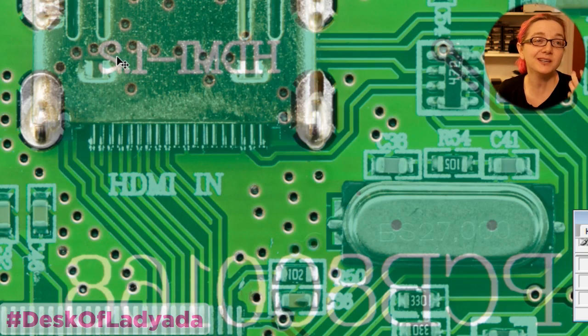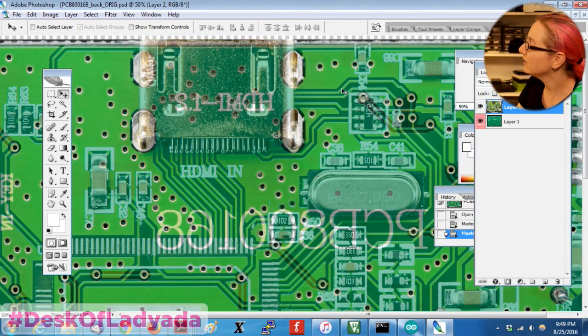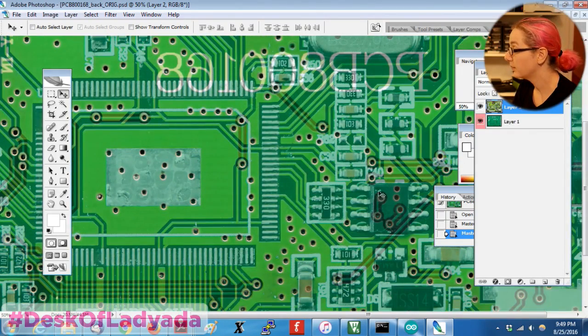Because I didn't remove the chip. So if you're really doing this, the way you want to do it is keep the passives on because they're simple two-pin connections, and then remove all the connectors. But in this case, the HDMI pins, I could just do a continuity test between this trace and these traces. So I just figured it out with continuity. And yeah, you can go through and then you can see all these pads underneath. So it becomes pretty simple.